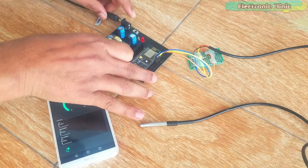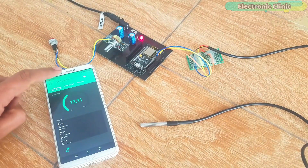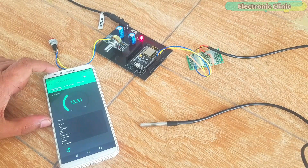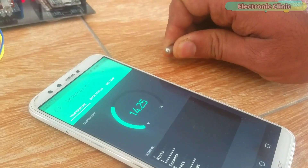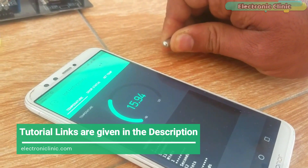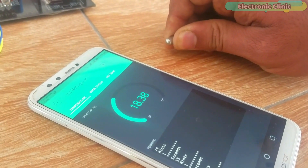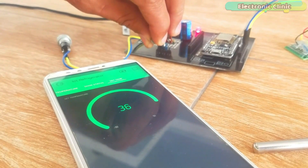In this episode you will learn how to convert any fridge or refrigerator into a smart IoT based fridge using a push button or limit switch, NodeMCU ESP8266 Wi-Fi module, a variable resistor, DS18B20 one-wire waterproof digital temperature sensor capable of measuring from -55°C to 125°C, and a cell phone application designed in Blynk. The values are updated every second.